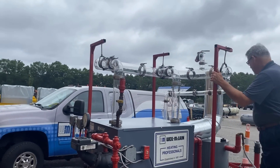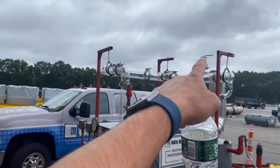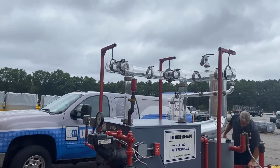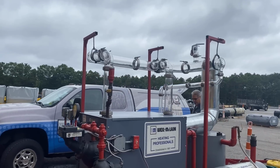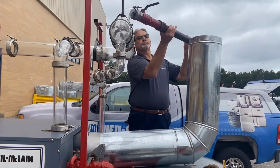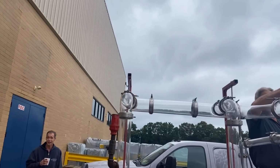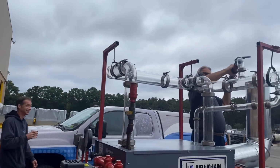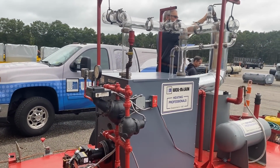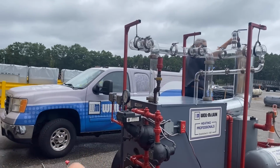No, don't shut it down. It's the valve on top. That's not a pressure relief. It doesn't have a 15 psi relief valve. Yeah, he's missing a relief valve. The two are redundant pressure controls.